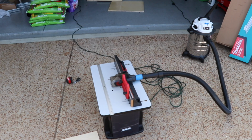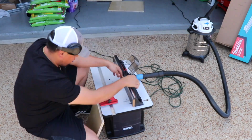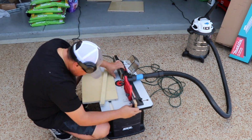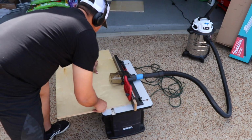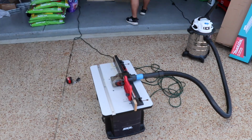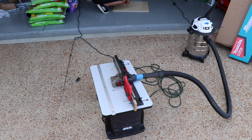I noticed I did forget to do a dado on, I think, the bottom edge of those side panels. I'm using a test piece because I want to see my thickness, and I'm using just my little router. Forgive me, I don't remember if it's the back edge or the bottom edge. I want to say it's the bottom. Just getting those bottoms routed because the panels are going to sit inside of those. I just like to increase that glue surface. This is all going to get glued and screwed anyway.